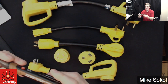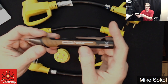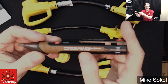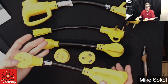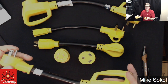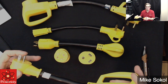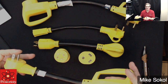I must remind everybody: once you hook it up, you're going to want to use some kind of non-contact voltage tester on your RV after you tie in, just to be sure you haven't messed up something in the grounding that could be dangerous. Southwire makes a nice product available at any Lowe's store, or on Amazon, as do Fluke, Klein, and others. Now remember, you're not going to be able to draw more than realistically 20 amps from this. You might get an air conditioner started, but that would probably be it. You probably would not be able to run anything else at all.